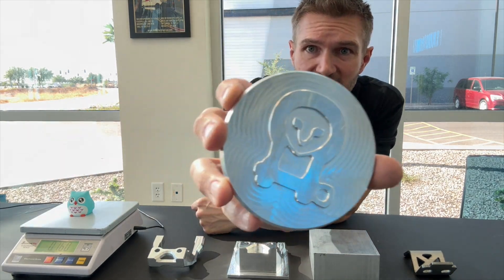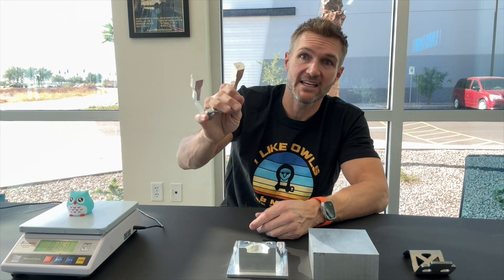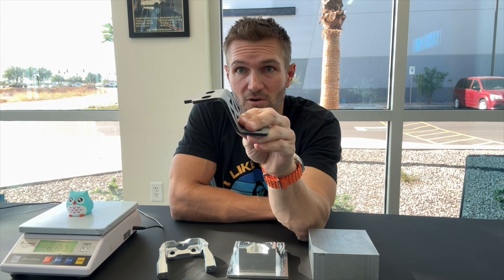Machining is a completely different process than the way you make other parts. I wanted to walk through exactly what goes into machining one of these brand new brackets that we use for the transit ladder. This bracket is incredibly strong, and that's one of the advantages of the machined part versus a part that is laser cut and bent. This is an example of what a laser cut and bent part looks like. These can be quite functional but they're not nearly as strong as a billet part.